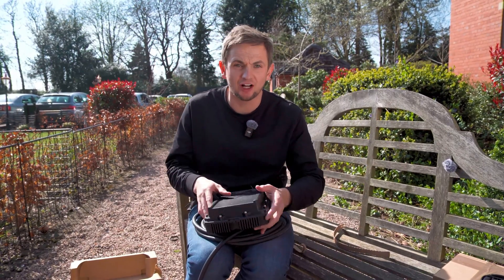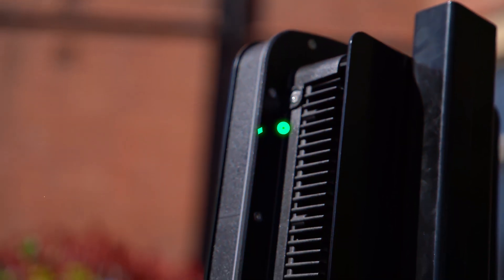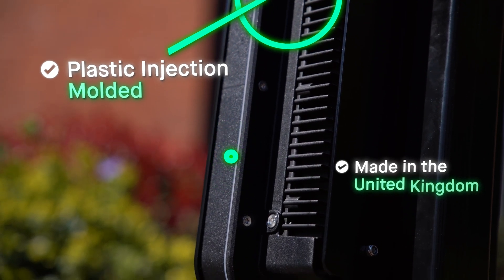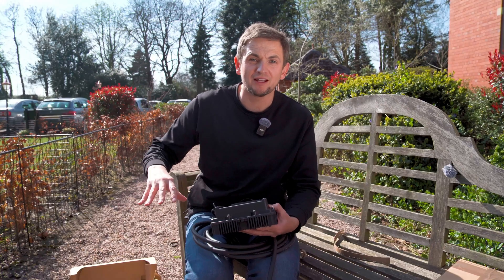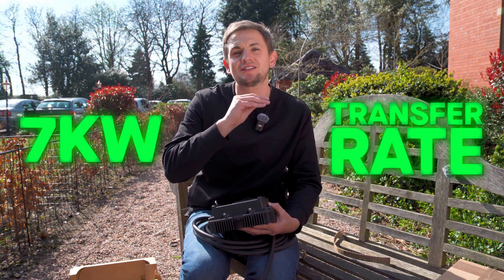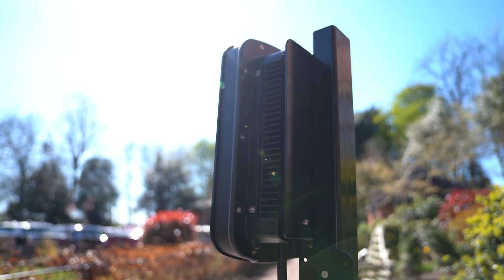So this is the actual charger — this is what sits behind that fancy cover. It's a pretty cool design; it's plastic injection moulded and it's made in the UK. As you can see on this actual case, it's got lots of little fins and these are all designed to dissipate heat. Chargers get hot — it's seven kilowatts travelling through this into your EV and if that's on for a prolonged time, even on a sunny day, chargers get really hot. So we essentially have a heatsink built into the unit.